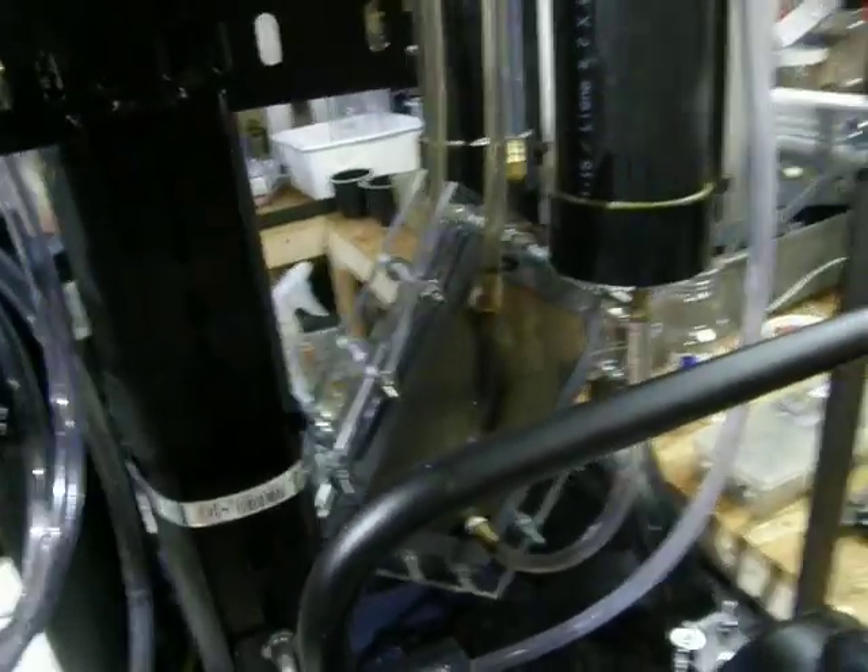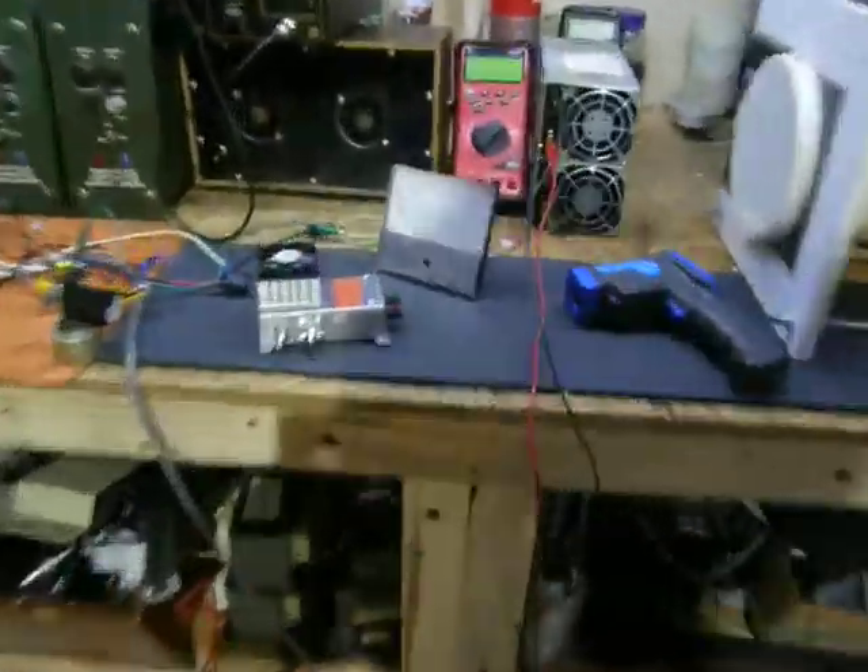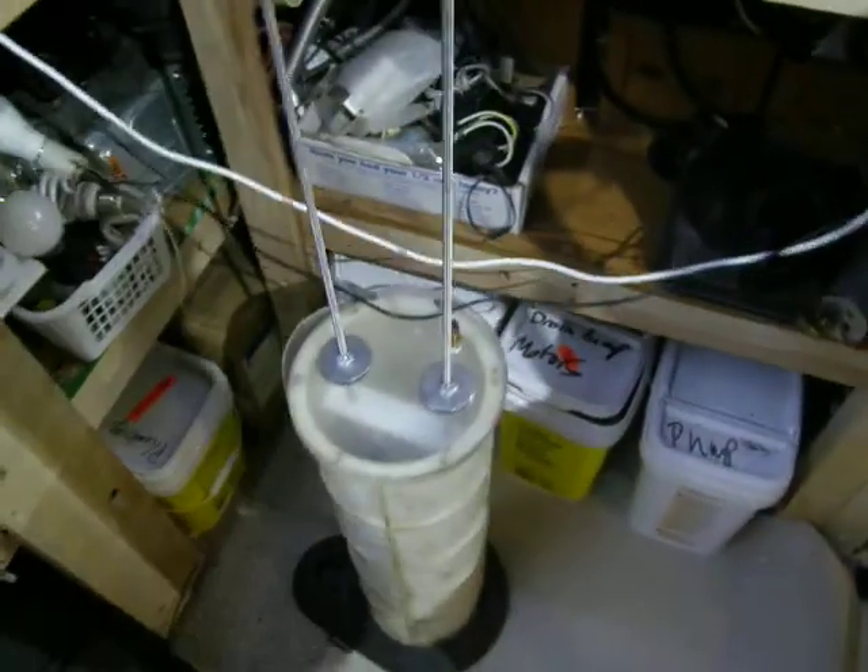Now, if you have a dry cell like this and a PWM like this, that's fine. But do not hook it up to a wet cell like this or you will fry it.